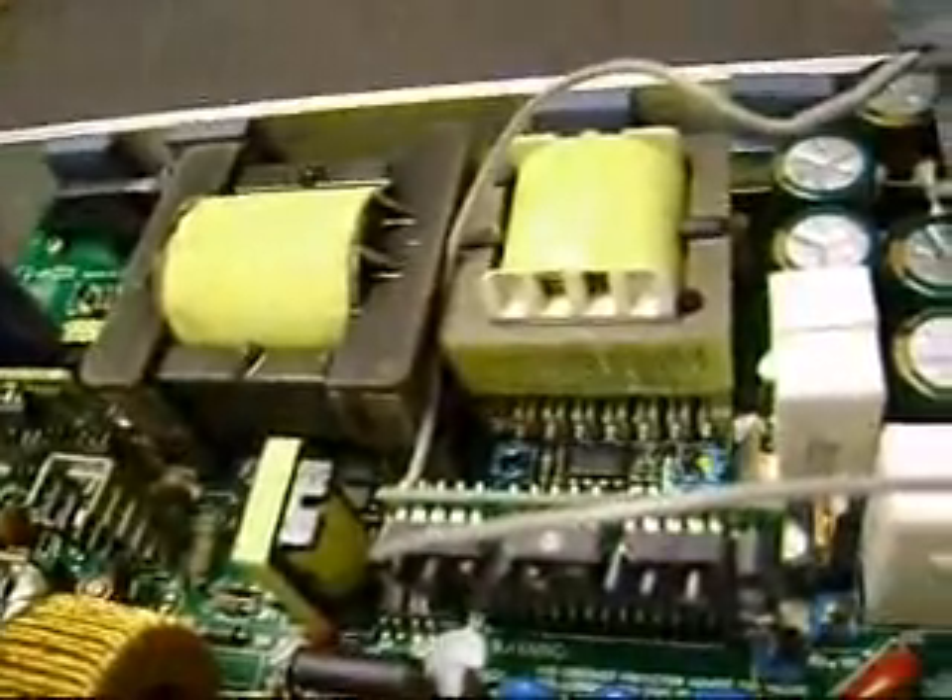The problem is here on this little daughter board. There are seven small electrolytics on here, and all of those electrolytics need to be replaced. I've experimented with just replacing some and testing them — don't even bother. There are three 1 microfarads at 50 volts, two 10 microfarads at 50 volts, a 4.7 at 50, and a 33 at 25 volts. All we have to do is replace those.